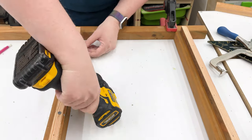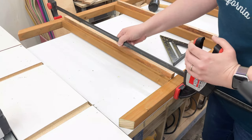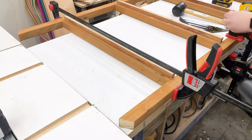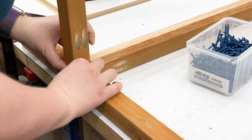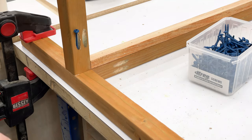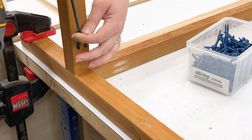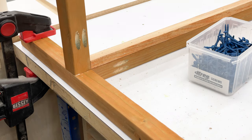The front and back are assembled like a ladder with all the pocket holes facing down towards the bottom. Check for square as you go and use clamps to hold the frame in place while you drive in the pocket hole screws. I always have trouble with pocket holes and 2x2s because the ends of the screws end up intersecting in the middle and causing the board to crack. To avoid this I decided to only use the pocket hole on the outside edge of the cross support.